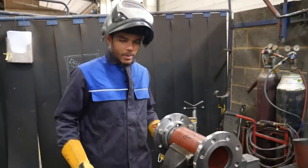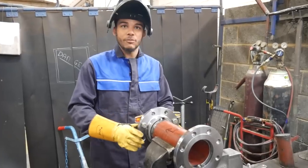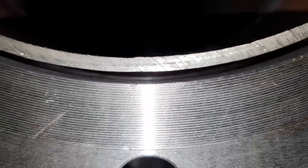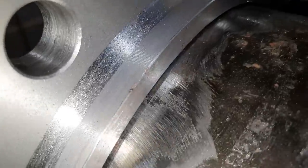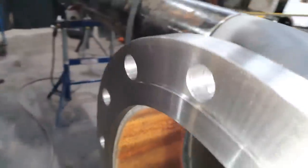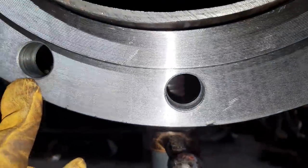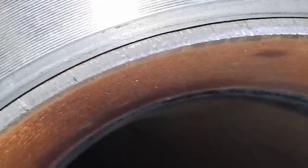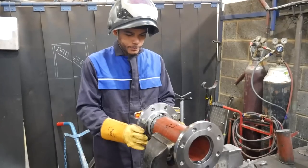It's more important to do this on bigger pipes - 12-inch, 10-inch, 14-inch - the gaps get really bad. Here's an example: this is a 12-inch flange just sitting on the pipe with no gap on top and a massive gap at the bottom. That would be a really hard weld - you'd probably need two runs to fill that gap, but if the top can only handle one run you'd end up with undercut at the bottom. Alternatives are tacking pieces on the pipe for the flange to sit on, or using shims to open the gap. It's not foolproof, but it's a simple technique that saves time when welding.